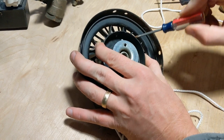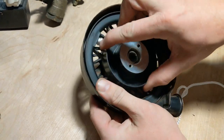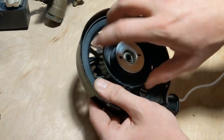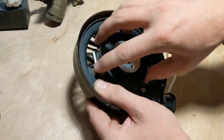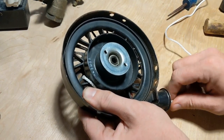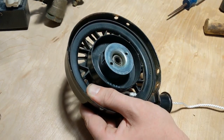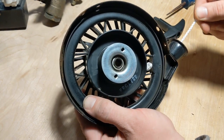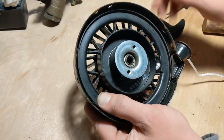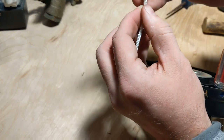Very carefully, I'm going to pull out the screwdriver that was holding this from spinning and gently let the tension spin out of this — just let it all go just enough so it'll hold that handle on there firmly. You want to make sure you don't let go of the wheel because the string will spin up and you'll never get it out.